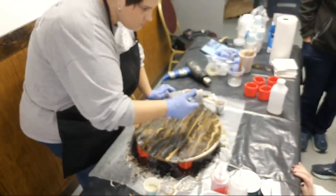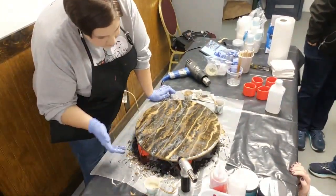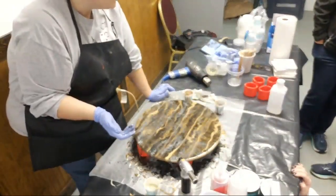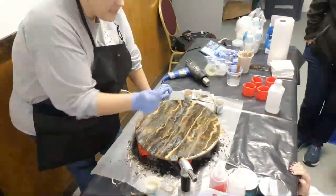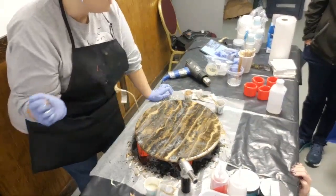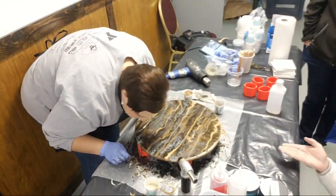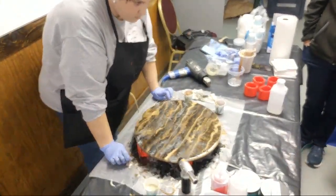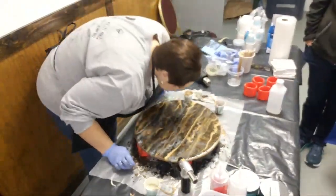And what will you do with your drips on the bottom? What I have done is taped off the bottom with masking tape, just right around the edge. So what happens is those drips are going to dry on there, and then when I'm finished I just take my heat gun and heat those up a little bit, and it pulls right off. No trouble. And it doesn't ruin your side edge? No, it doesn't. I've painted before and gotten too close.